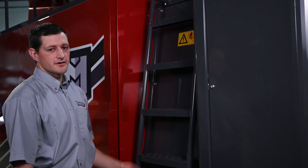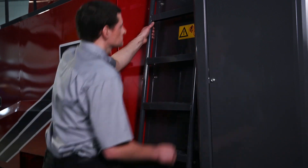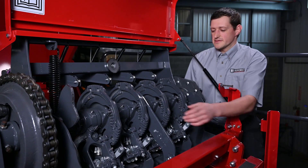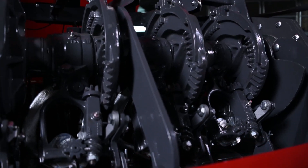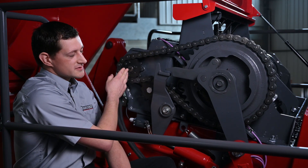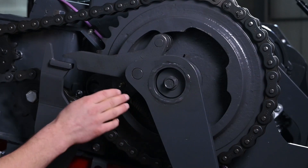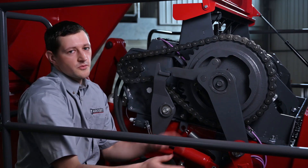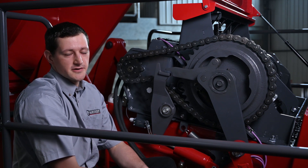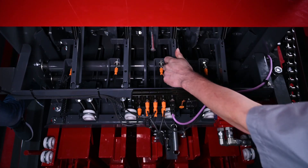Now let's go up and have a look at the knotter. You'll notice our new angled ladder has larger steps for better climbing. We now have a center support on the knotter shaft to eliminate or reduce deflection when running at high speeds. The motor is now mounted ahead of the knotter for better clutch disengaging and less stress on the knotter. The knotter drive sprocket has four lobes on it, which shortens the tie cycle. All this adds up to 25% faster knotter speeds. We also added individual sensors on each knotter for more accurate sensing of knotter misties.